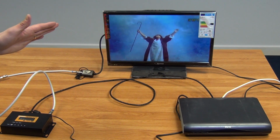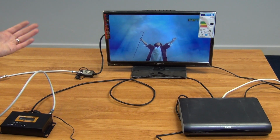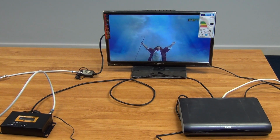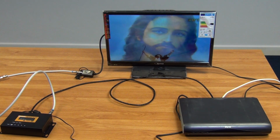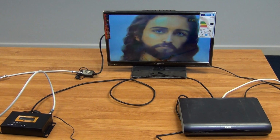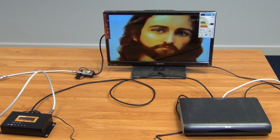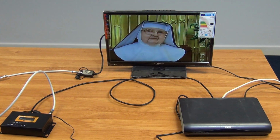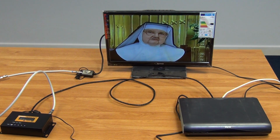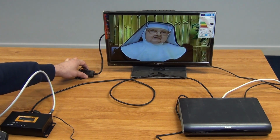So that if we had a remote TV, we can actually not alone view the picture remotely, but we could also put a Sky-Eye on it or a distribution amplifier off to a number of different TVs and work the set-top box with a remote control. So in this case, we're going to do it with a Skybox and an I/O link. But if we had an older Skybox, we could do it directly off an RF2 output, or if we had a set-top box or a combo box, we could do it via Tri-Link or something like that that's giving a 9-volt output.